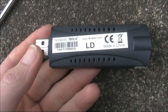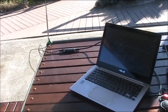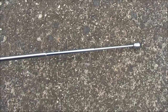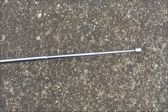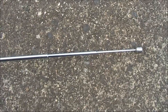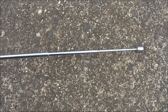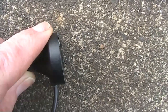These RTL dongle sticks are great fun for VHF and UHF reception, but the antennas they come with are often poor. For a start they may be only 30 to 35cm long — that's a little bit short. Ideally you want it to be at least 50cm long, to be a quarter wavelength on bands like 2 metres or 144MHz. An antenna of that length would also be fine for reception of the 430MHz amateur band. The other issue is no radial, which would provide even better reception.